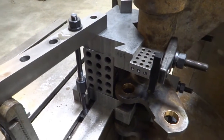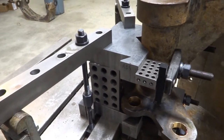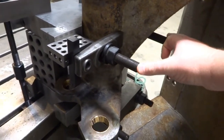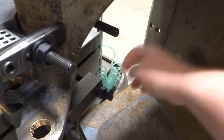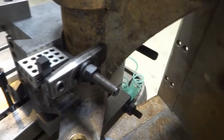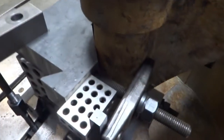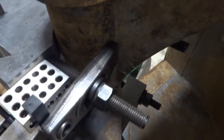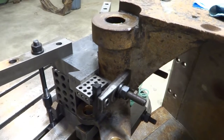I came up with this idea of using my 2-4-6 blocks as a spacer and putting the second v-block on top and just clamping the whole thing down, and it stiffens it up quite a bit. I won't know until I actually go to drill the hole, but it's definitely a lot stiffer than the single v-block. The major problem I had with the upper v-block was this gusset — the threaded rods won't stick out past it to put a nut on, and it's going to want to dive down and bend. So I came up with just using a strap clamp and a heel block, and it seems to be working — it's pretty rigid.